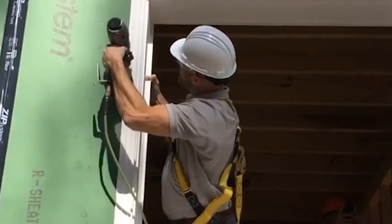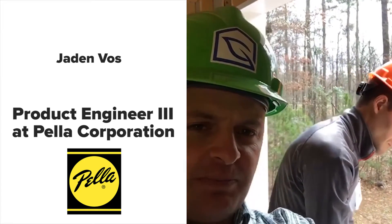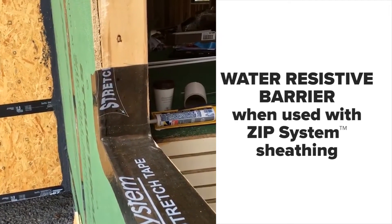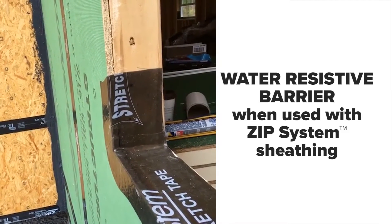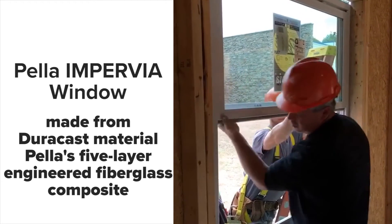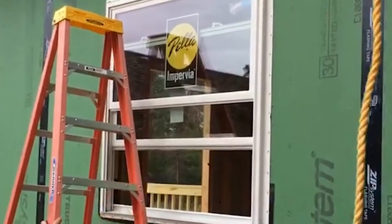Now we're going eight inches on center. We slide in the Deco Flash with a 3/8 bead of adhesive behind it, plumbed, and now we're just fastening the Deco Flash to the structure. Now we're with Jayden from Pella, continuing with this Deco Flash window installation. We're putting a bit of caulk adhesive around the inner side of the frame. Now we're taking you through the step-by-step of installing a window using ZIP stretch tape and ZIP tape. Right now this is your stretch tape on the windowsill — it should go six inches on the window jamb. Now we have the crew sliding in the window and making sure it's plumb and level before we permanently secure it.